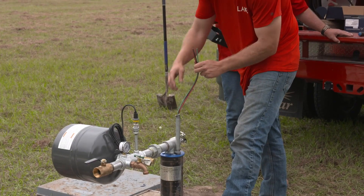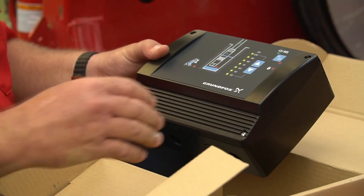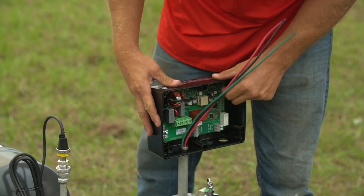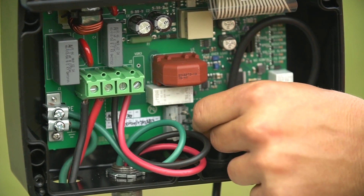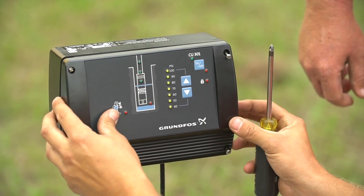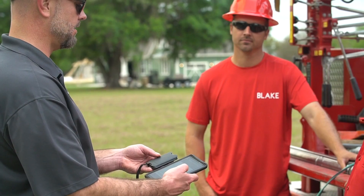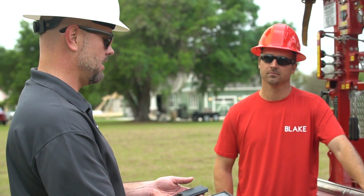The pressure sensor keeps the pressure constant at the place where it's installed. The CU-301 is rated for inside or outside use. If installed outside, keep direct sunlight off the unit. Communication between the CU-301 and the pump is via the power supply cable. Since you have already connected this cable and the pressure transducer to the CU-301, only the cable to the main power switch needs to be installed. Complete this connection. You are now ready to activate power to the CU-301 and start the pump. You can use the Grundfos GO dongle to adjust system settings and activate the pump. The GO can also be used to lock the system when settings have been selected, to ensure a homeowner does not inadvertently change pump operation.